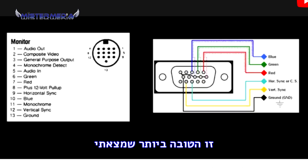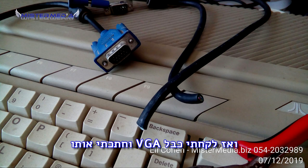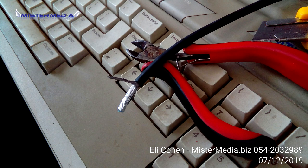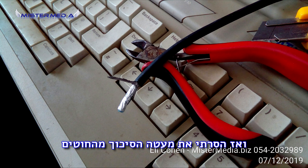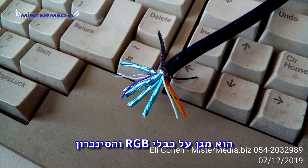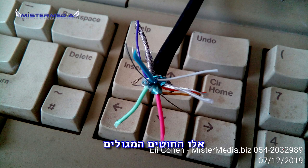Then I found a VGA cable, which I cut — just cut the cable so that I'd have one connection at the end. This is the cable after I cut it. Then I had to reveal all the wires, remove all the shieldings. You can see aluminum foil shieldings for the RGB and for the H-Sync and V-Sync — horizontal and vertical. Here you can see some of the wires unshielded.